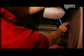The balloons are piled into an industrial washing machine and a cleaning solution is added. The machine heats to a steamy 71 degrees Celsius, while the balloons tumble and nozzles spray water onto them. This doesn't just clean the balloons — it completes the vulcanisation of the latex.